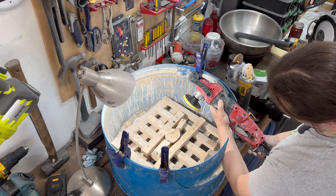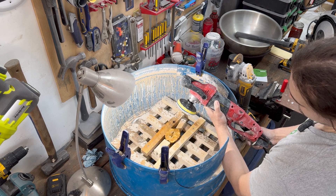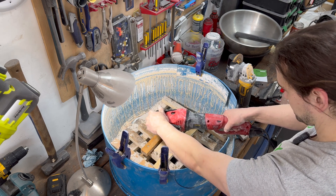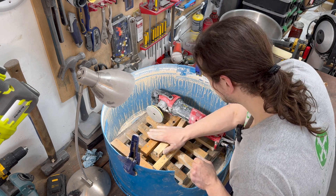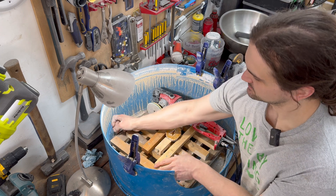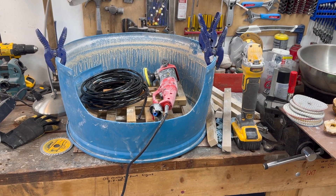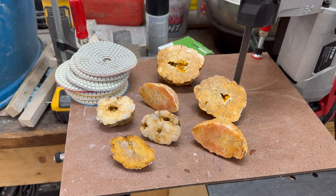Let's turn on the water. That's too much — we'll dial it back to just a trickle, just a drop — and let's get polishing. There we go, looks pretty good. Just finished up with the 6,000 polish, ran it dry. Gets a little warm but not too hot. There we are, looks good. That's a look at my setup for cutting and polishing geodes. And here's a look at the finished product. As always, thanks for watching, and until next time.